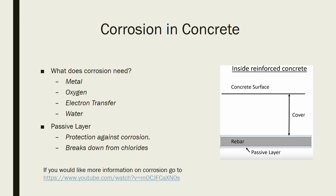The good thing is concrete naturally has what is called a passive layer — it's protection against corrosion. As long as the passive layer is there, your rebar will not corrode. The problem is when too many chlorides get into your concrete, you start to see a breakdown of the passive layer, which leads to corrosion and pitting in certain areas.